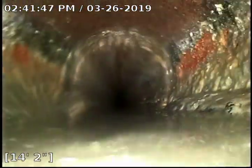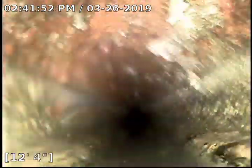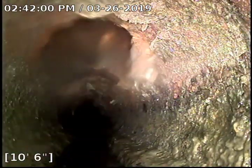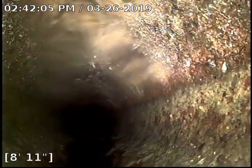I'm going to go under water here for a second — it's probably a belly in the line there. We're transitioning into cast iron here, and you can definitely see some of that sludge buildup on the bottom side of the line. It drops down — a little bit of a rough ride, I apologize.